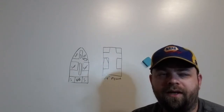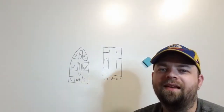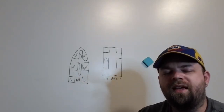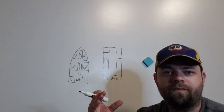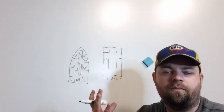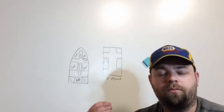Now some people would say, go get the exterior grade plywood. That's still too expensive. I'm going to get the cheapest plywood they have. Well, maybe not the cheapest. They make different grades of plywood. One is more dense, so it has fewer air pockets in it. The other one has air pockets because it doesn't matter for what they are usually used for. So I got something that is pretty dense.